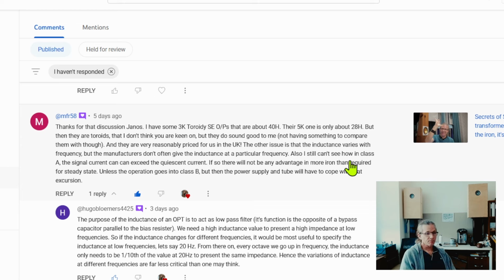Basically, whenever you have toroid transformers, especially big ones, even if there's just 1 volt DC or half a volt DC on your line, you can already hear it humming because it just saturates that beast. Even if it's a 1 kVA core, if it is saturated by 1 or 2 volts DC, then your amplifier that's fed by that iron will sound as if it has 1 or 2 watts of power supply, not a 1 kilowatt power supply.